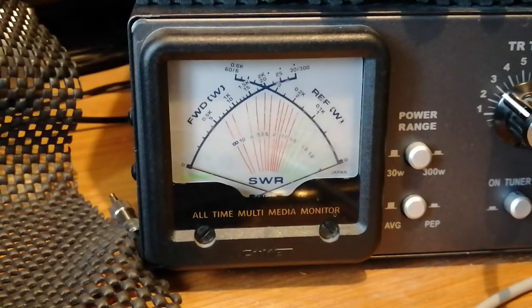I personally would not recommend tweaking the pots. Ten to 15 watts output on these radios, I think, is more than enough. The finals on them are pretty robust, but you don't want to push them — you don't want the radio to get too hot. So this is a nice balance. It's not one of these export radios that puts out 30, 40, 50 watts of power. But given the right propagation, 10 watts — as I've proved using my foundation licence — will get you thousands of miles. So happy with that, and it does open up the menu with many other options.